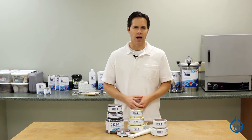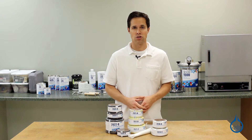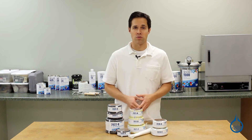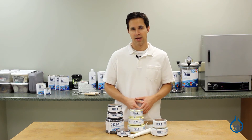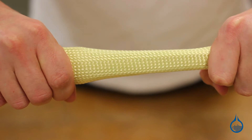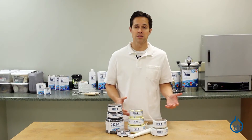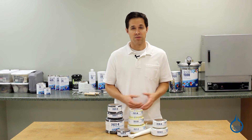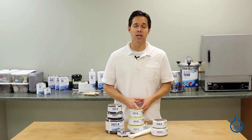As a result, sleeve will accommodate a variety of sized applications. It is generally meant to be slid over cylinders and prepared mandrels to make hard laminate tubing. This unique construction also allows it to conform to the shape of products with changing geometries like hockey sticks and prosthetics. Sleeve makes the precise manufacture of such parts more predictable and repeatable over time.